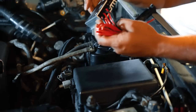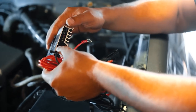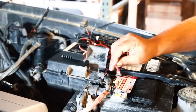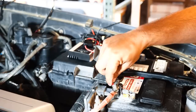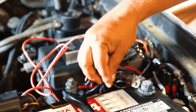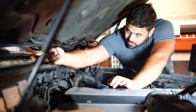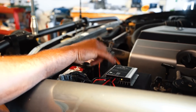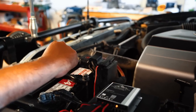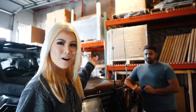Mount the charge controller with the lights facing out so you can see what the charge controller is doing — a full description of the light indicators is included in the instruction manual. Bring the positive wire to the positive side of the battery and negative to negative. The wires are quite long so the controller doesn't have to be close to the battery, and you can shorten them or keep them in case you want to relocate the controller later. Bring the solar panel cable to the MC4 connector and you're done. If it blinks fast it means it's charging fast — very simple.